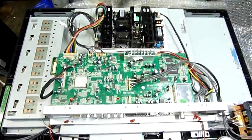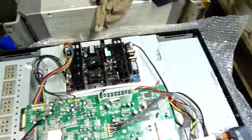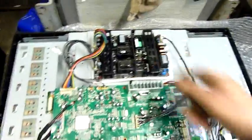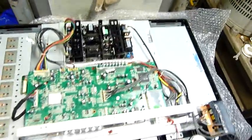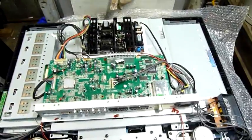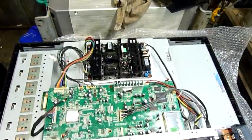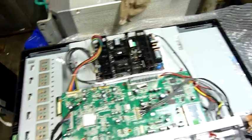So I'm going to have a quick look at the PCB and cable connector on the back of the panel itself — there's a little board there. I'm going to take the base and all this stuff off, pull the power supply out, re-solder it, even pop some of the caps out and just ESR them, test them with the meter.